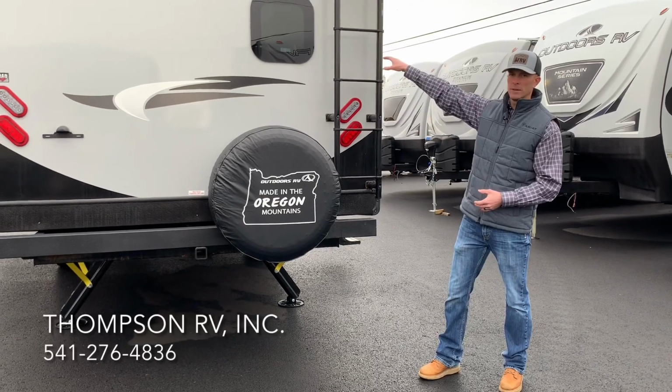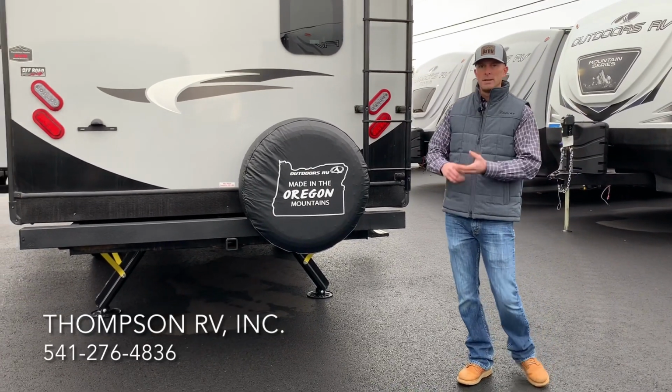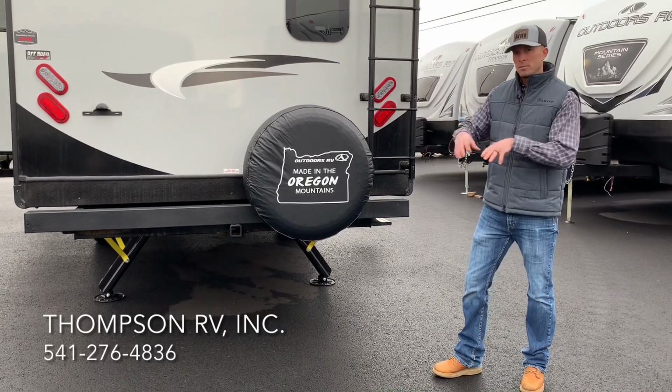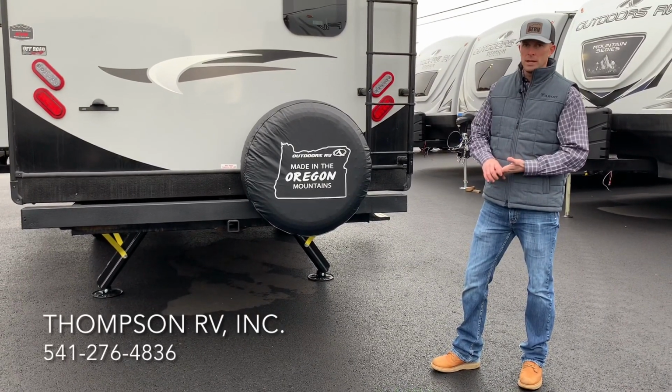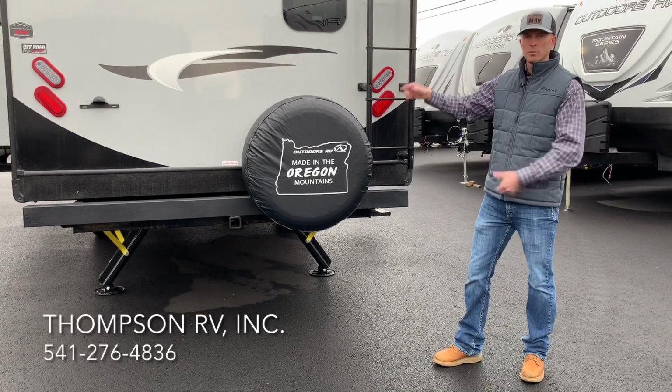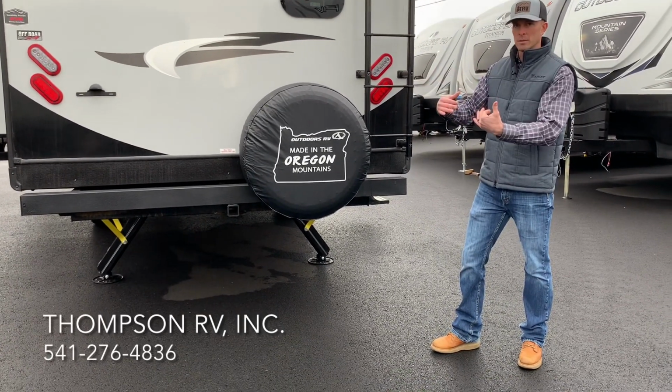Along the top of the roof up there, where the roof vents are, the attic vents, if we had solar up there like this one does, in spots like that, we're going to use a self-leveling Dicor. Along the edges, we're going to use a non-leveling Dicor, because we don't want that Dicor to settle and run over that fiberglass.